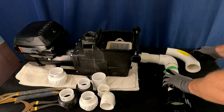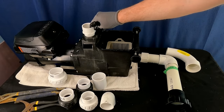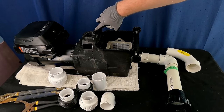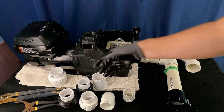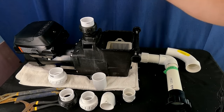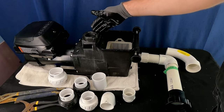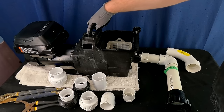We've talked a lot about the suction side, but let's talk about the pressure side connection. Same as the suction side, you could use a regular male adapter, but on the pressure side this is even more subject to heat damage causing staining and leaking. You can see this pump here has already experienced a leak from using a regular PVC Schedule 40 male adapter — it's really just not the right tool for the job. The high temperature threaded male adapter union is definitely the way to go if you have that option.